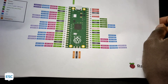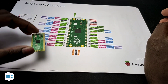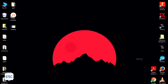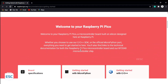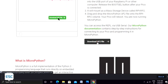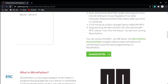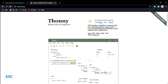Now let's see how to upload code to Raspberry Pi Pico. We have two options: MicroPython and C++. I'm going with MicroPython because C++ programming on Pico is a little tricky for beginners. First, connect Pico to your computer while holding the push button. A storage device will appear with two files. Open the index file — it will redirect you to the Raspberry Pi website. From there, click 'Getting Started with MicroPython', download the UF2 file, then drag and drop it onto the Raspberry Pi Pico. Then we need a Python IDE — I'm going with Thonny because it's official and easy.